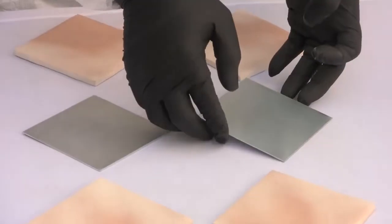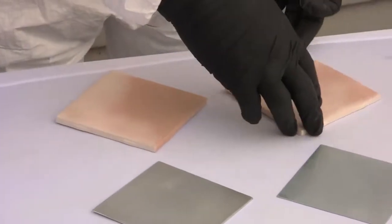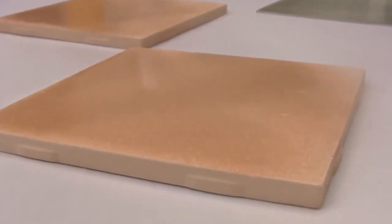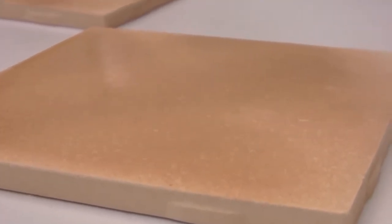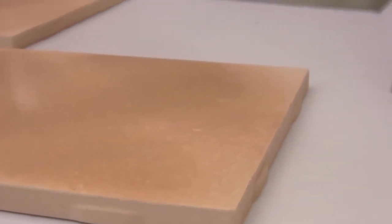In cases where it is possible, rotating the surface between passes may be beneficial to ensure that all angles of the surface are completely covered. Proper application of the bottom coat will result in a dry film thickness of 0.25 to 0.5 mils, or 6 to 13 microns per coating layer. The bottom coat adheres to the surface and allows for proper, consistent application of the top coat.